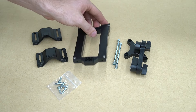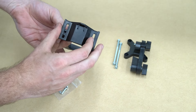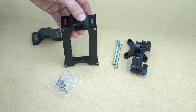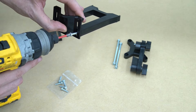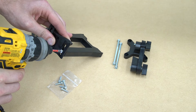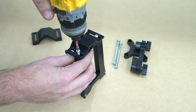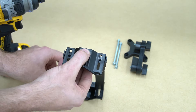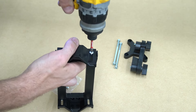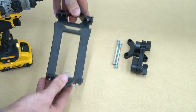In this video I'm using the 10.8 inch screen, so we're going to set the screen mount up for that. We'll start by identifying the top and bottom of the screen mount. On the bottom front there are two countersunk holes for screws to go through the plastic and into the mounting arm. On the very bottom we'll find two holes for our bolts, which hold the plates that retain the screen onto the spring loaded portion of the mount. We'll use a number two Phillips head screwdriver to secure these in place, then repeat the process on the top. The orientation in which these plates are installed determines which size screens fit — you can flip them upside down for smaller screens or as shown here for larger ones.